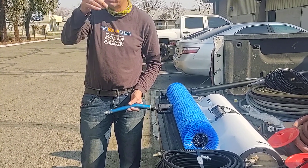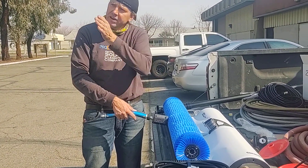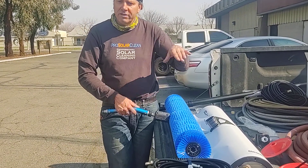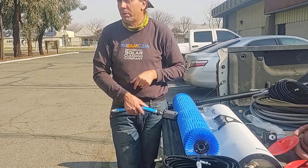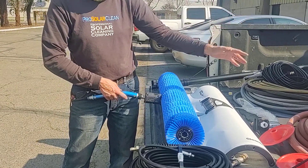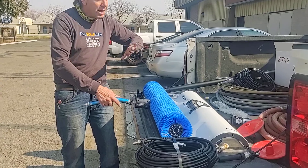When there is high wind, the wind might pick up your brush, so it's safer to divide the work — six and six, seven and five, eight and four. Be careful at the end of the installation: the brush tends to follow gravity and if the installation is not perfect, it might go left or right. Water is distributed across the full brush width, so when cleaning, do the edge three or four times, then move the brush half the width of the panel.